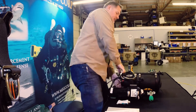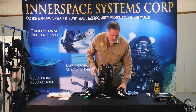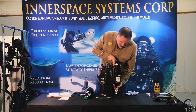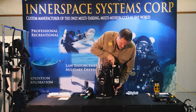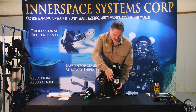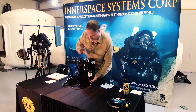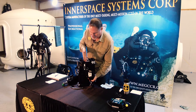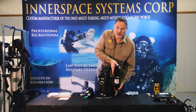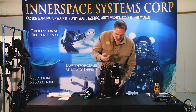I'll stand this up one more time. I'll go ahead and do the dil first — I'll hold the dil in this manner and put it in place. Gently install it, making sure the ring is going down. You don't want this ring to be folded and get pushed in the folded state next to the cylinder and the gas plenum canister — you'll never be able to remove it without a piece of string or something. So always make sure it's out like that.